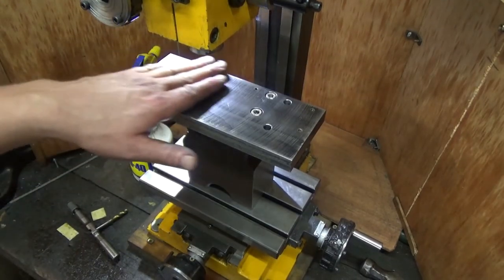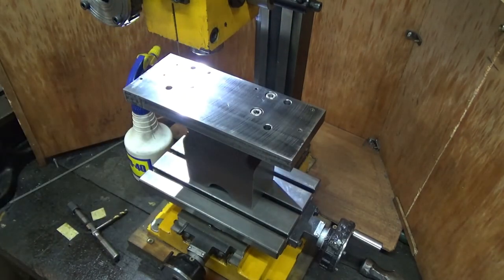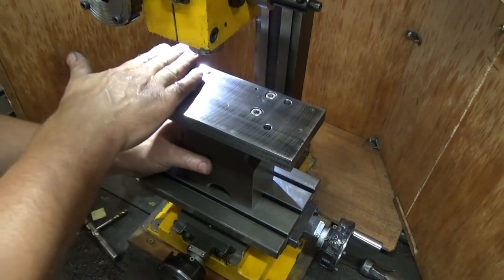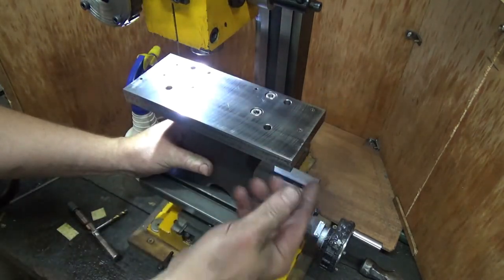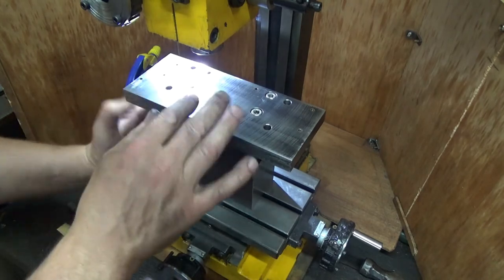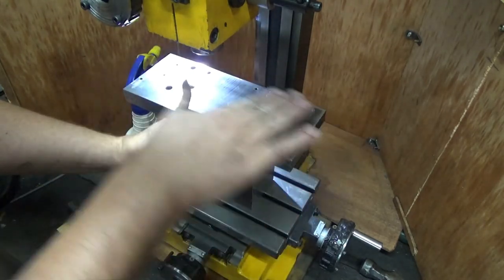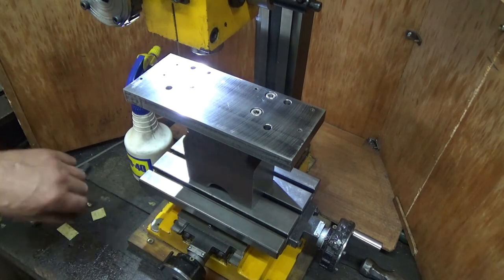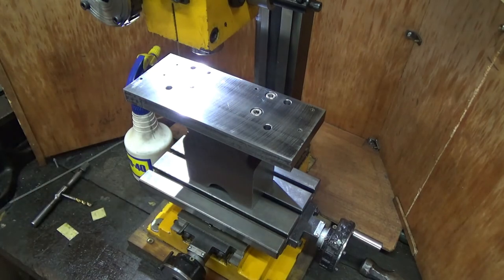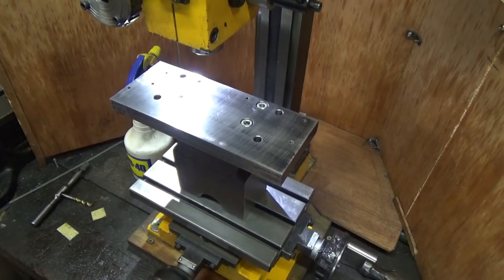So the drilling and tapping went nearly uneventful. The first punch I made was from my old steel. I couldn't tell, it was in my mystery steel pile. It came out of a printer. I thought printer rods would be at least chrome molybdenum. Clearly not. So then I got a piece of silver steel out, made a new 6mm punch for my hole finding centre punch, and did that. Pull it out so you can see it a bit.